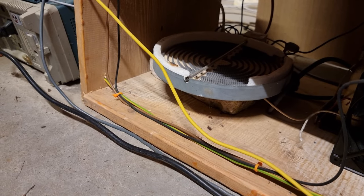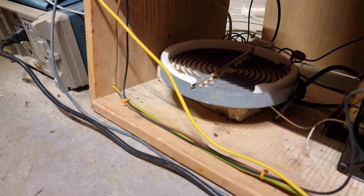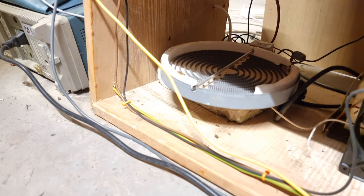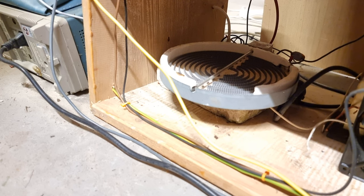Well, when you have this shortcut, I'm afraid I will damage the diodes, because when it's like a shortcut, all the power of the transformer will be a current, and then maximum current, and it might blow the transformer. So this is, let's say, a protection device, and that's the reason probably also that the voltage goes to zero.